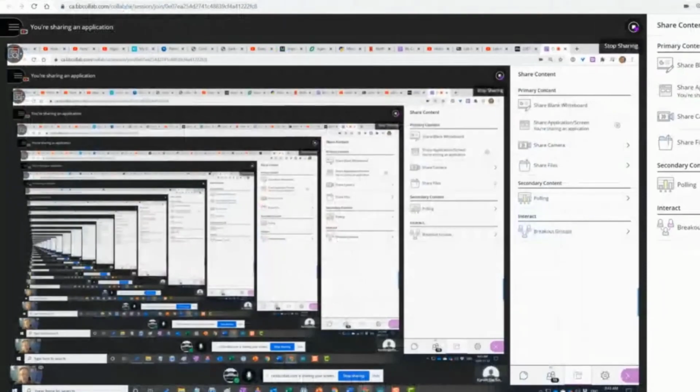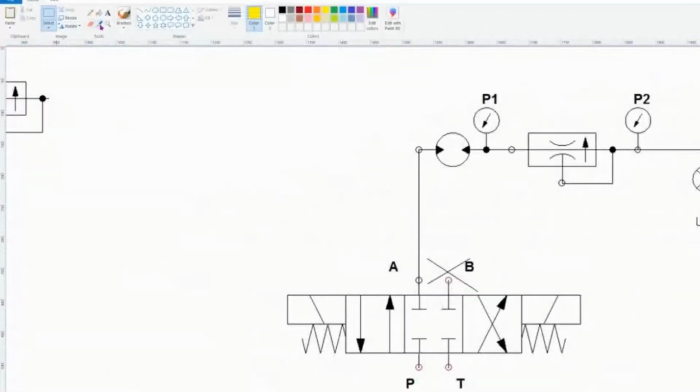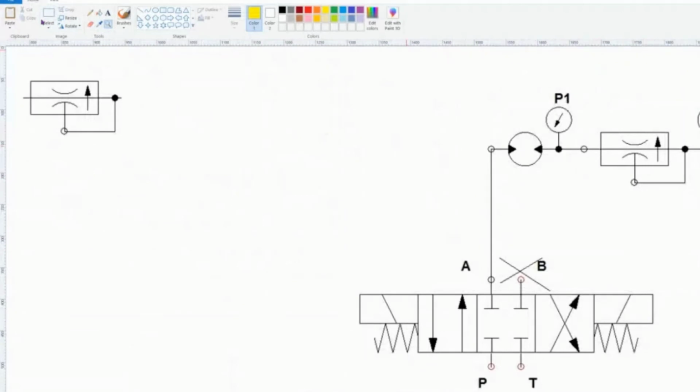What happens in hydraulic systems is that you may ask the question, okay, well, I get that. I get the fact that we need this pressure compensated flow control valve because my pressure may change. And if it does change, I still need the same flow. So I'm going to make sure that the size of the orifice is compensated for either a greater pressure or a lower pressure.